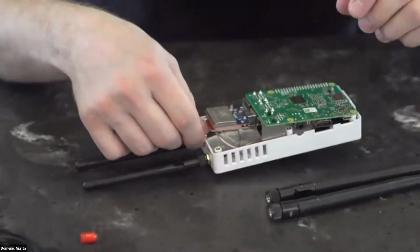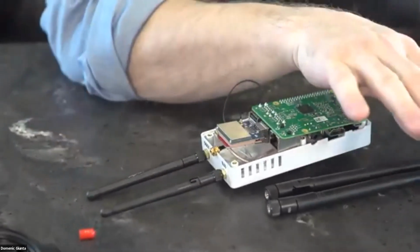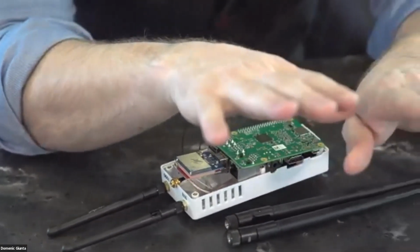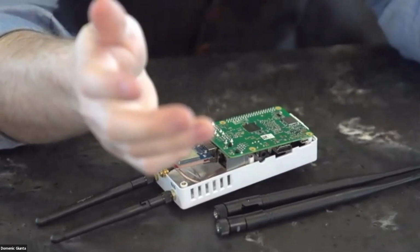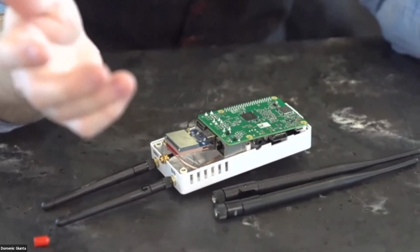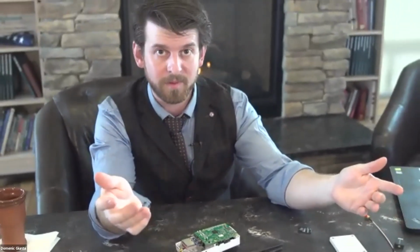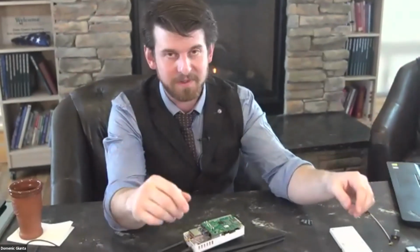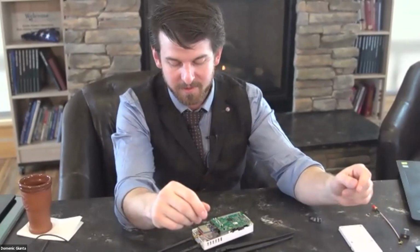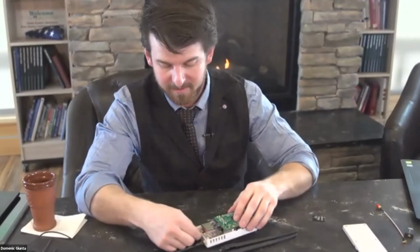And Ryan, while you're doing that, we have a question here. Is it necessary to use an anti-static wrist strap? Can you repeat that? I don't know if they can hear me on the mic. Yeah, the question in the chat is, is it necessary to use an anti-static wrist strap? I thought someone may end up asking this question. I've never used them. The electronics aren't that sensitive, but if your house is super dry, or wherever you're putting this together has really dry air and you've been walking around on carpet with your cotton socks on, maybe discharge yourself somewhere or wear a wrist strap. But I've never used one. It's not super sensitive. I'm sure some electronics professional would enjoy arguing with me on that.